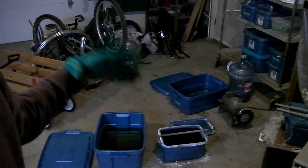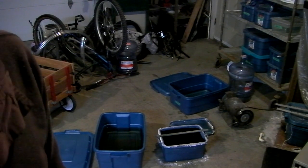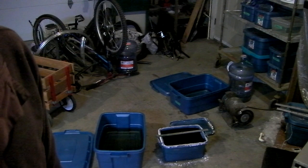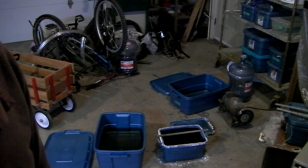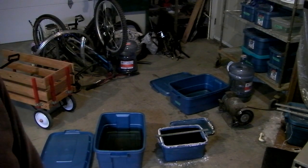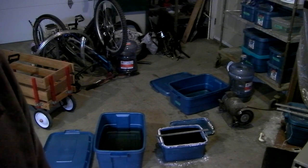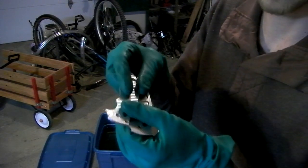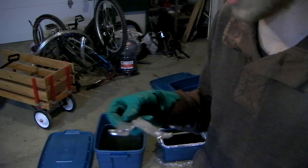Now that's going to take anywhere from 5 to 20 minutes — it all depends. When I started anodizing about a year and a half ago, I wasn't making so many aluminum parts myself. So to give myself practice, I would anodize paintball guns. I don't really play paintball — it's a fun sport but not for me. I would do quite a bit of paintball guns for local guys, because they're all anodized aluminum. You'd have to strip off the original color and re-anodize it another color. I love making my own handles because right off the machine, a quick tumble gets them nice and shiny and deburred. These are raw aluminum — I don't need to strip them or sandblast them. These are ready to be anodized. It just saves a lot of hassle in the anodizing process.